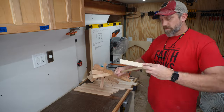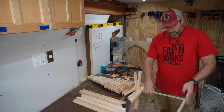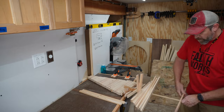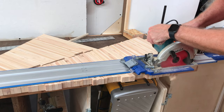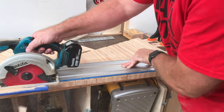Next, slide all your pieces onto the dowel rod. Remember I said the miter cuts were only approximate length? Now we're going to trim it down so our edges are straight. The line we made before should be pretty close. You can just freehand it with a circular saw, or since I have one, I'm going to use my circular saw track.